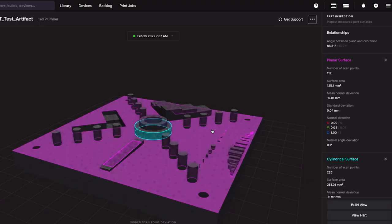Let me show you one of the reports that Blacksmith will automatically generate for this part right here, which can be easily printed, shared, emailed, or accessed through IGR Fleet APIs. On this report you can see all the information about the part itself: the specific internal structure of the part, the infill, the density, the layer heights, and the types of fiber used to reinforce the part.